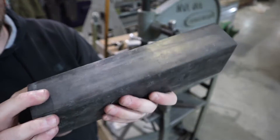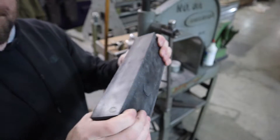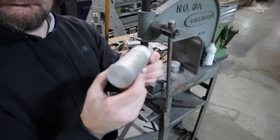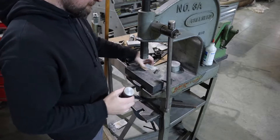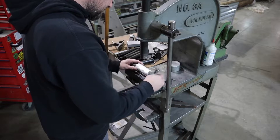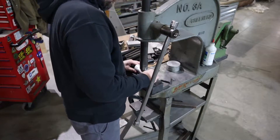I got all my back bent and fins all tacked together. This is a chunk of urethane rubber. I'm going to take this chunk of urethane rubber and this chunk of 1¾ inch solid aluminum, and I'm going to press this piece of aluminum into the urethane, and it will give me the radius that I need to fit this inside my bezel.